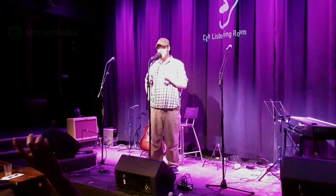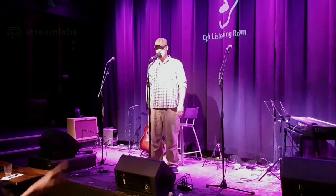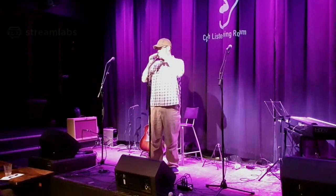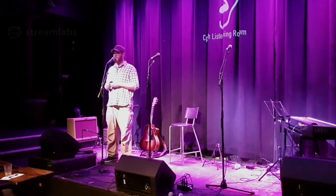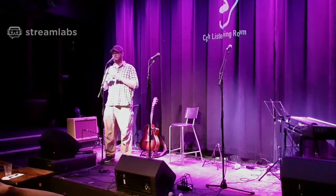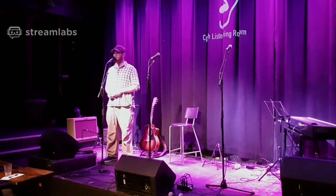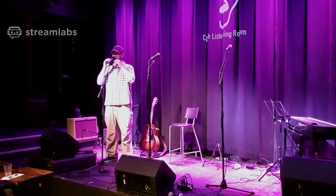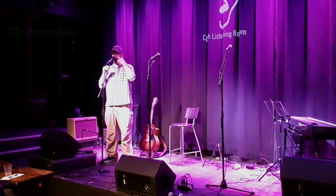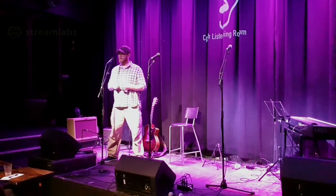The handheld microphone. Also, if you guys got questions, please just throw a hand up. Could you try and put the windscreen on that one over, and the one they use down here? Just to hear what the difference is. One, two. One, two, two, one. Some of the acoustic... There's a little bit of difference, right? Part of it is my breath hitting the membrane. There is basically a pop filter built into the capsule of the microphone, but it doesn't grab that much. And, for example, P's is a bad one.